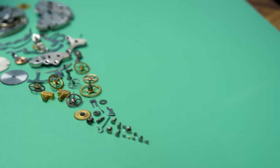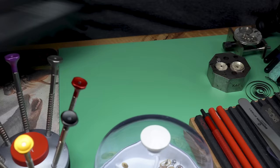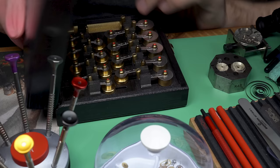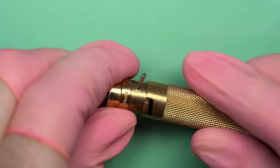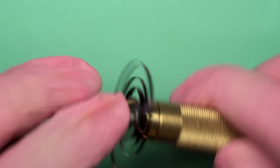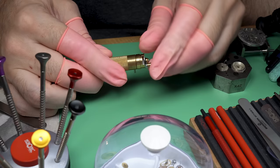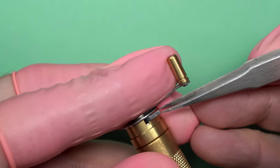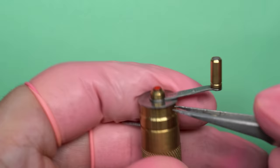Take a look at the movement all laid out — that is a lot of parts, but it looks good. It cleaned up pretty nicely, especially for an older watch. I think this one's probably from the late forties just by the styling and the technology. The first thing we need to do is take care of this mainspring using my mainspring winders. You technically can do it by hand, but it's very difficult to do without contaminating the spring. The mainspring winders are very expensive, so it's a bit of a pickle for amateur watchmakers until you can save up.